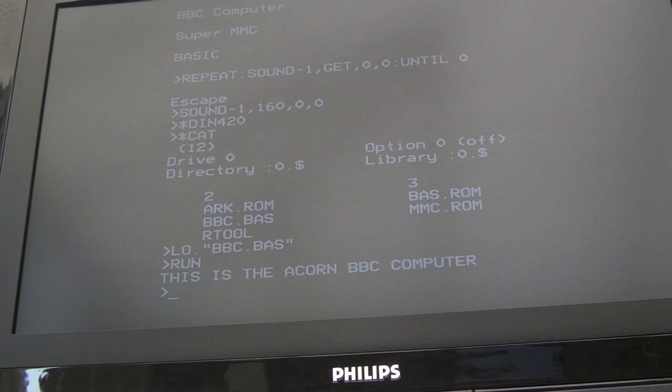Then I think you run it through that utility, and it will analyze the sample and apply the linear predictive encoding to it. The net result is, say your sample's 8K. By the time it's encoded, I kid you not, it could be as small as 10 bytes or 16 bytes. It could be tiny. So this is what's amazing about this chip. The compression ratio is phenomenal, really.